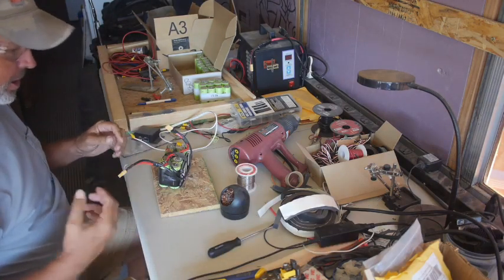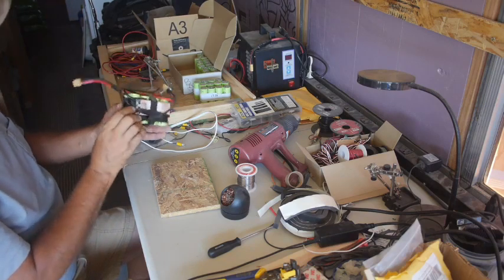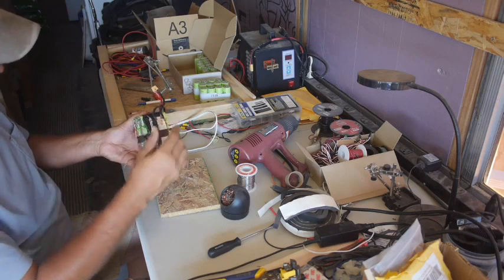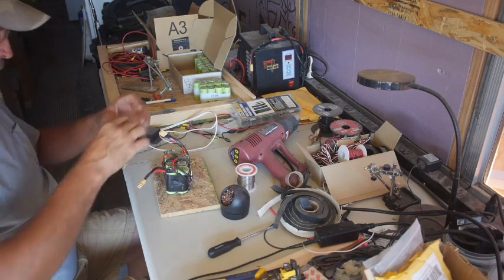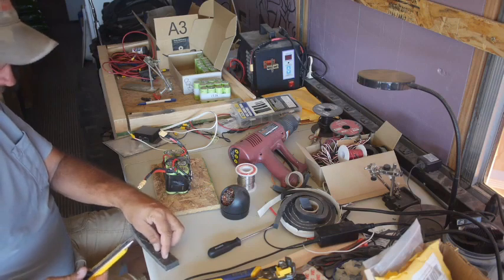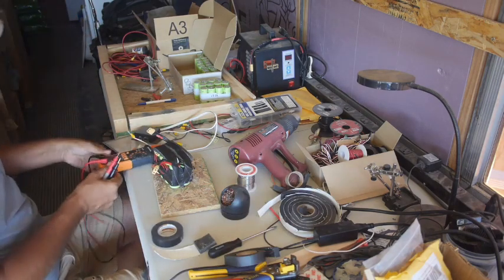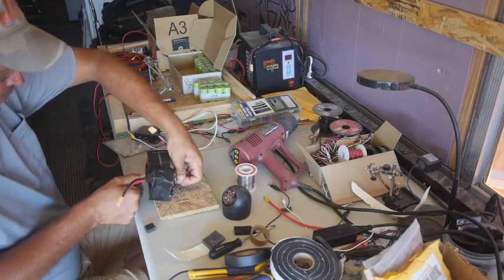If I completely encase it, then I can't inspect it later. But then if it still rattles loose, I won't know it. Also, this is the battery management on the side, and I'm concerned about excess heat if it's entrapped, right? Also, I found some weather stripping. I think if I put that across the top to kind of press down, tape across that, this should help push them down, keep them tighter. 13.3, okay, that's good. I really do want to be able to take these apart once in a while and check them.